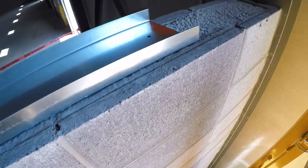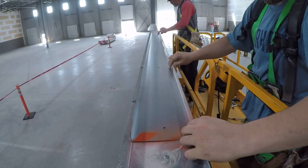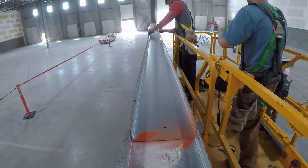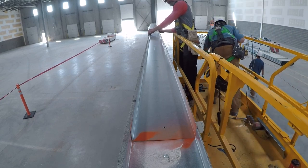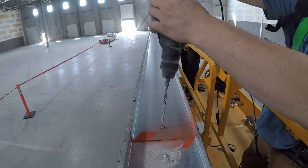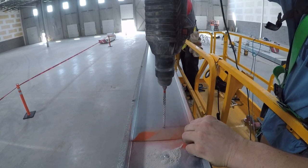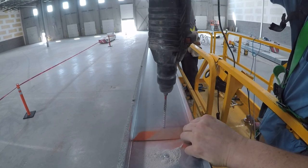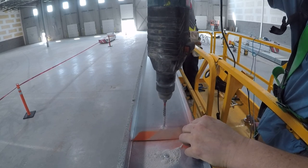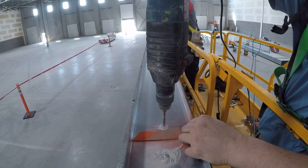It's good to work in pairs — it'll definitely go quick. I like the three-man crew; it's the perfect number. This is the hammer drill — it's a quarter-inch bit. I use the Hilti bits, quarter inch, same with the pin bolts, quarter inch. Obviously you pin one end, and on this super heavy-duty gauge it'll never bend in the middle, so you go right to the other side. Basically, anything that's not light gauge, you can pin either end down.